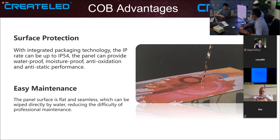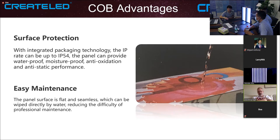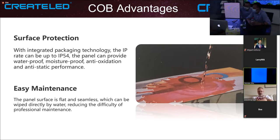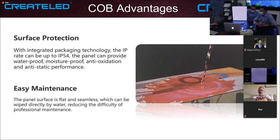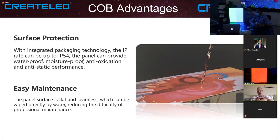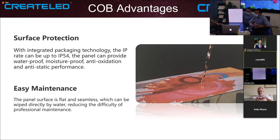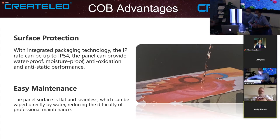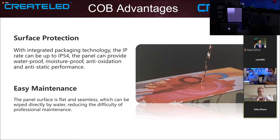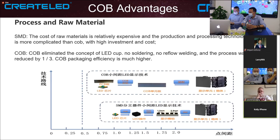That means this one can be used for outdoor display as well, is that right? If it's outdoor, it needs to be IP65. Yes, IP65. So that's different altogether. IP54 means limited ingress. So if you want it to be completely outdoor, then you need an IP65 rating. But this, as Cheng has already mentioned, is a product more geared towards an environment where it could be in a window or a totem. You mean under the patio area? So probably just sort of half indoor. Yeah, fair enough.